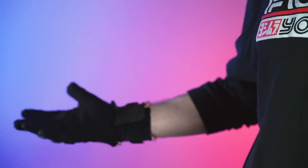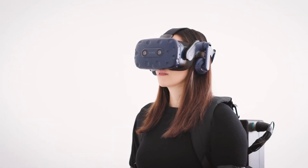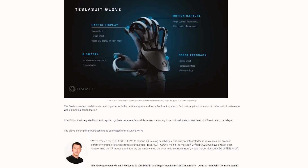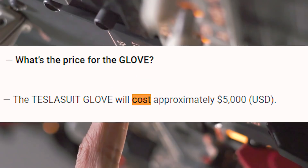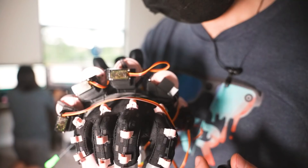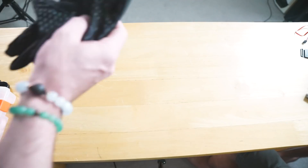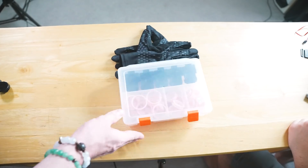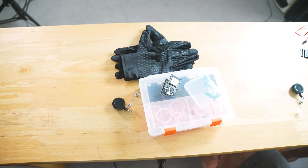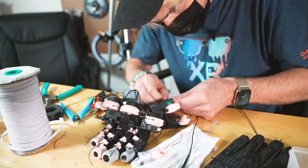I've tried many VR gloves and covered even more, but just about all of them are completely out of reach for like 99% of all VR enthusiasts. The Tesla glove is just one example of a manufactured VR glove with similar features, but it'll run you around $5,000. Compare that to this, where all you need is a handful of components that only cost a few bucks and a few hours of your time, and you have a fully functioning haptic force feedback glove. All you need are gloves, 3D printed parts linked in the description, pulleys, a handful of potentiometers, an ESP32 or similar microcontroller, servo motors, some wire, basic tools like a crimp or soldering iron, and quite a bit of patience.